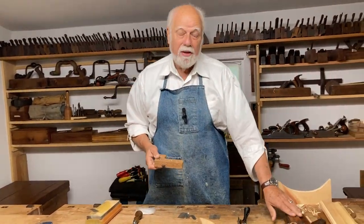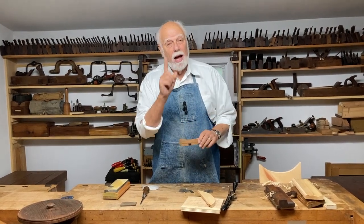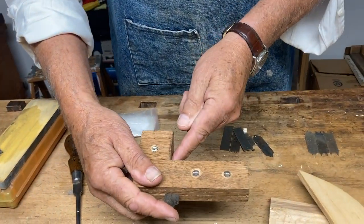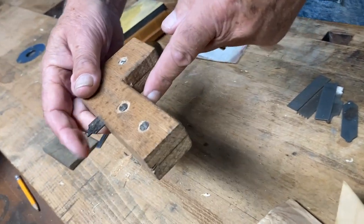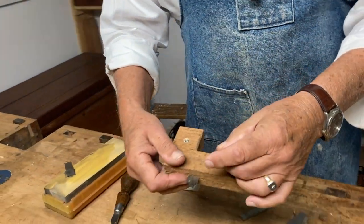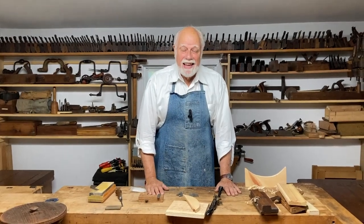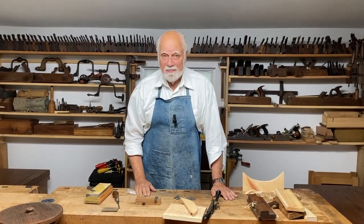For my money, much as I love the beading planes, I really like the scratch stock because it can do curves as well as straight things. Plus, if I loosen the screws that hold the two pieces together, I can move the blade anywhere I want, so instead of making a bead right up against the corner of the workpiece I can make the bead in the middle. And of course, if I used a blade that had multiple teeth, I could do reeding. That's one of the advantages of doing woodworking by hand. If you like that and want to learn more, don't forget to press the subscribe button and then the like button. See you soon.